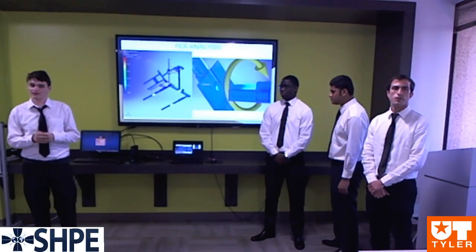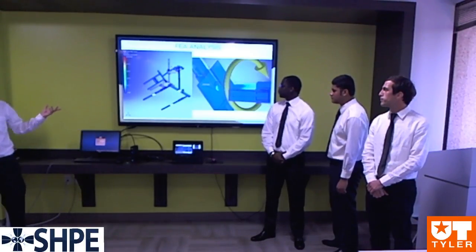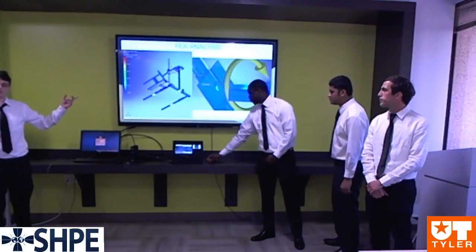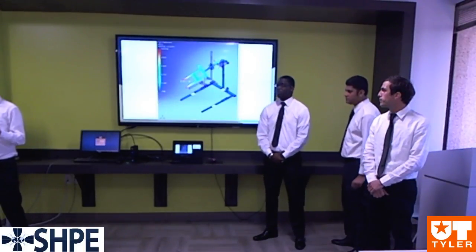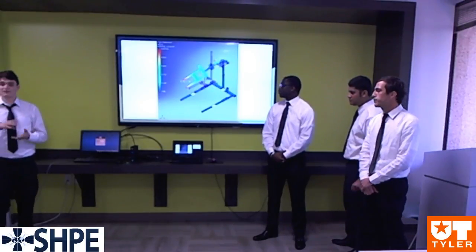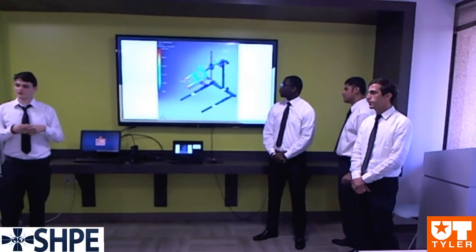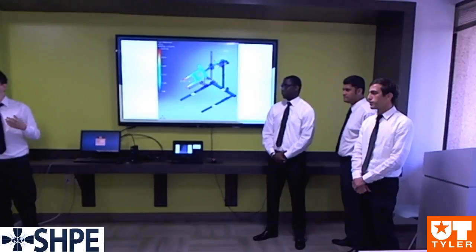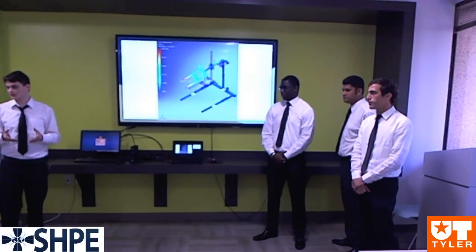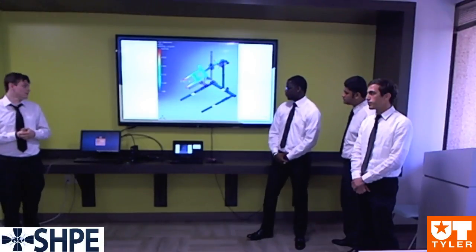As you can see from this picture, the first picture is the entire lift with the FEA analysis, and the second is a zoom in of the highest point of stress, which is on the rotation axis, as we predicted. This maximum value is 26 KSI, comparable to the yield strength of steel at around 30 KSI. So we shouldn't be experiencing any permanent deformation of our lift.